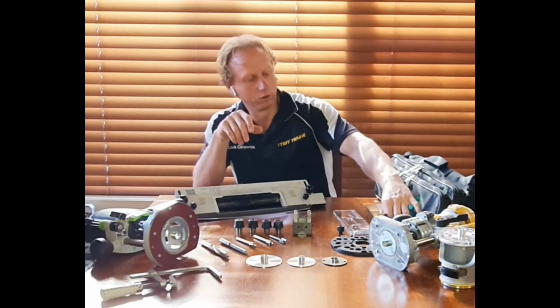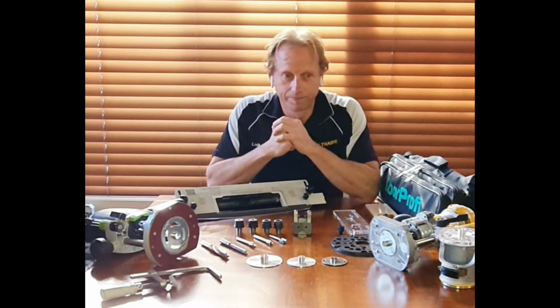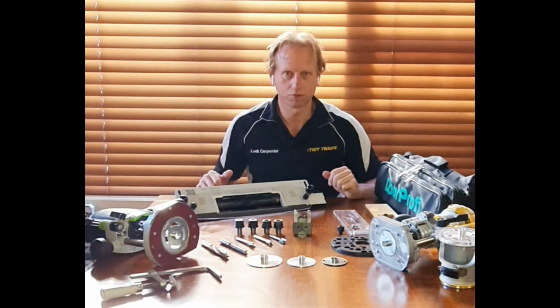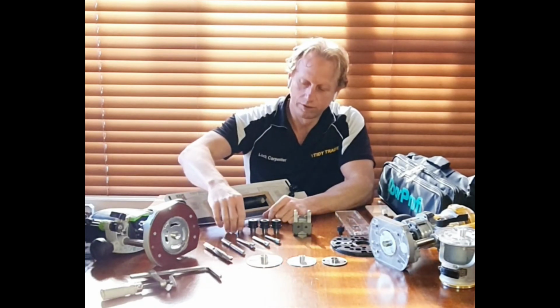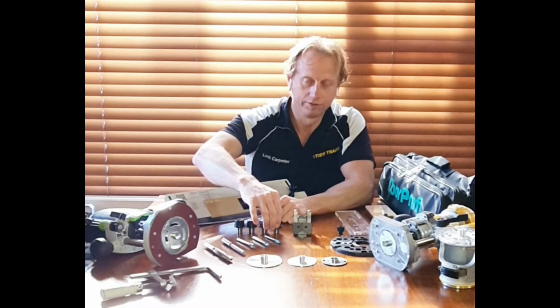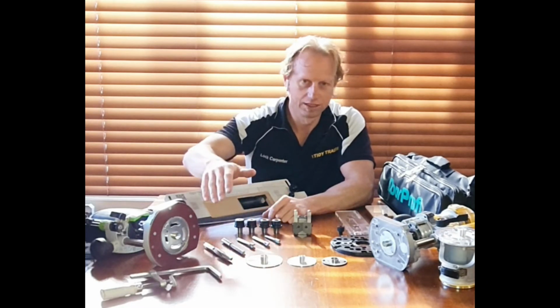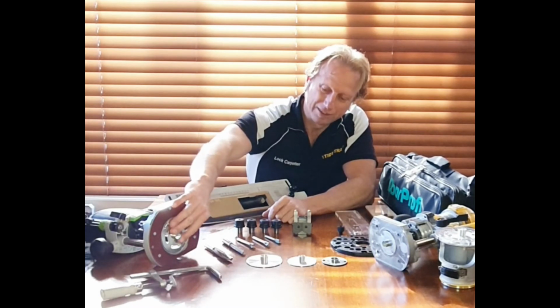So you really need all of those. There's no point just having the one, because it's not going to help you. We want to make it as easy as possible. So we cover all bases with Festool. We've got the 6.35, the 8, the 12 and the 12.7. So you can take any range of cutter. With the copy ring, we're working with 17.